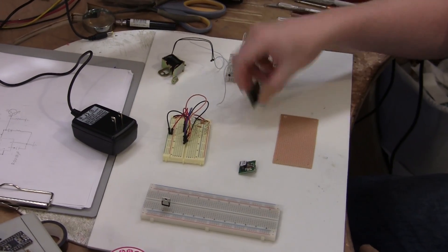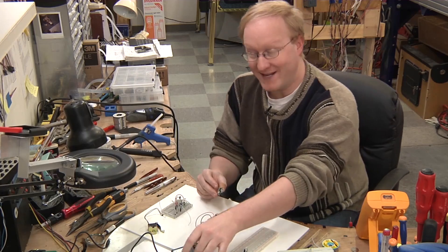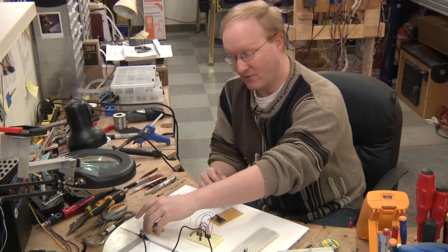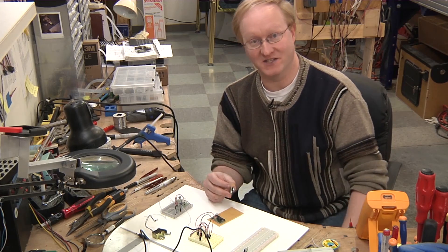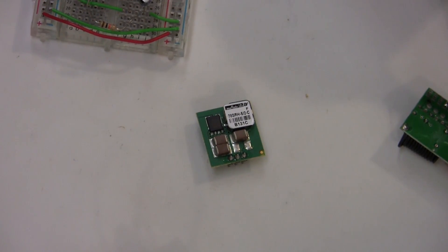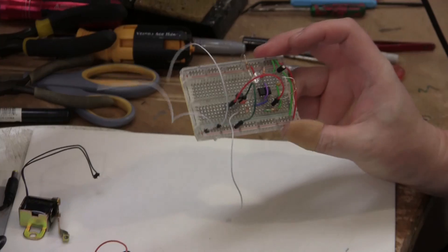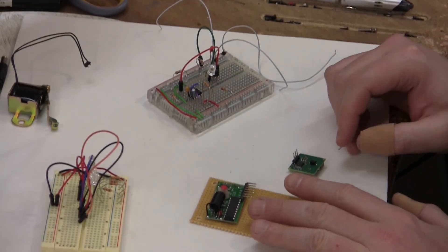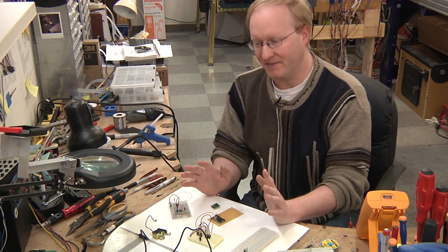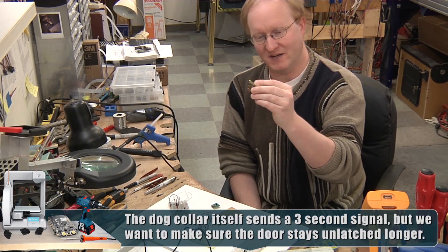Here are the elements I'm going to combine. Here's the key fob receiver. Here is a five volt switching power regulator. We need 24 volts off of this wall wart in order to activate the solenoid. We could use a linear voltage regulator but going from 24 down to five would create an excessive amount of heat. By using a more efficient switching regulator package we can do the 24 volt to 5 volt conversion much more efficiently. This is a 555 one-shot timer — basically the same circuit as before but on this one it's going to run for about 10 seconds. So if the receiver sees any signal from the key fob it'll activate the coil for 10 seconds, which should give the dog plenty of time to go in or out.